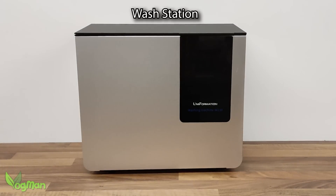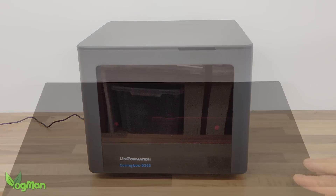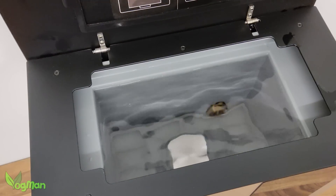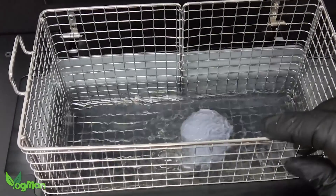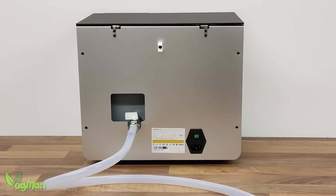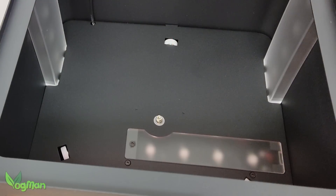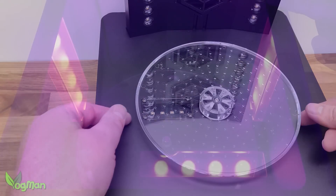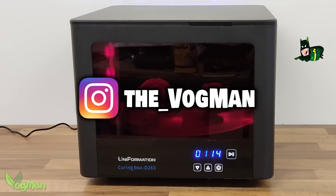Uniformation also kindly sent me their curing and washing stations, which honestly deserve videos of their own — because again, there's innovations. Uniformation goes for ultrasonic cleaning, which personally I feel is the best cleaning method. This holds up to 7 litres so it's a big boy, coping with large prints. These can be slotted in neatly, still attached to the plate, or there's a wire basket for after the supports have been removed. The attached lid prevents any nasty airborne cleaning solutions, and thanks to this drainage tap and provided hose, emptying the device of dirty solution is wonderfully easy. The curing station has UV lights everywhere, even beneath the large turntable — giving the best 360-degree coverage I've personally come across. It's just… a proper job.